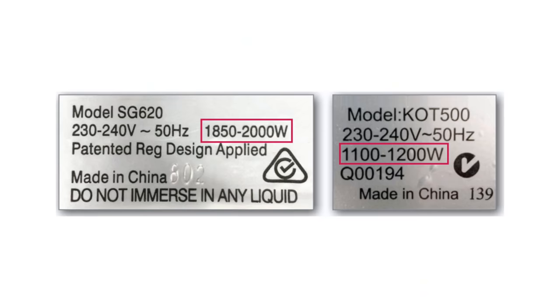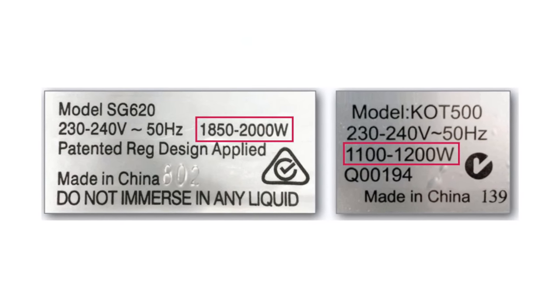As we go through this discussion, I'm going to try to stick to watts and watt hours. A watt is basically a measure of energy, and the reason I'm going to be using that versus voltage and amps and things like that is because watts are watts. Whether you're talking about DC watts or AC watts, they're kind of the same, so you don't really have to do a lot of conversion other than the energy lost across the inverter. Another convenience there is that most of your appliances do list their energy consumption in watts, so it makes it much easier to figure out what you need.